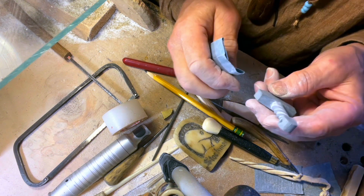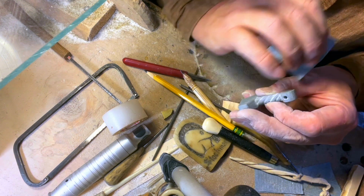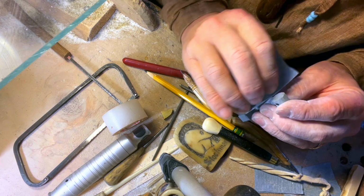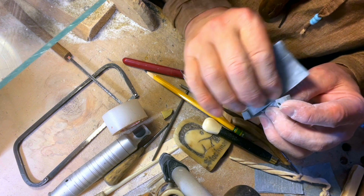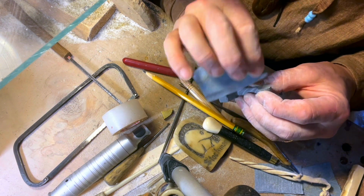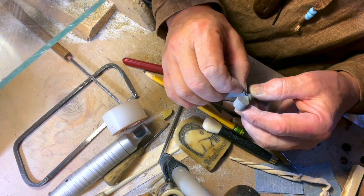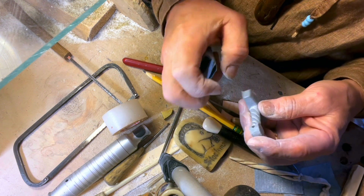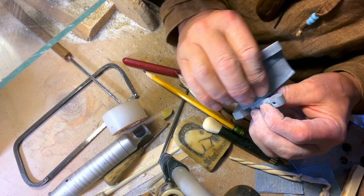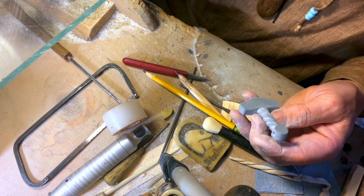We'll say this much about sanding and finishing slate, pipestone, and other stones: even though you could use steel wool on it, I wouldn't, because the steel actually wears off onto the stone and leaves a darkness, a blackness that's very difficult to get off after it's on. And the other thing is, when I've made some pipes and used steel wool, it polished down the surface, but like I was saying about little hard inclusions in the stone itself, those don't go down with steel wool, but the surrounding material does, and therefore you get these bumps, not usually what you're looking for. Stick to sandpaper.